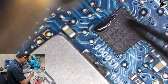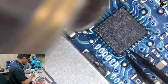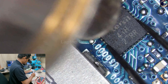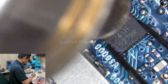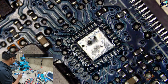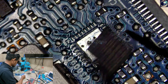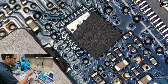So let's remove this charging IC. Okay, IC removed. Now I will replace a new one. Here we go — same part number, 9241H. Let's solder this IC.